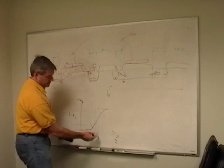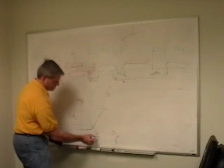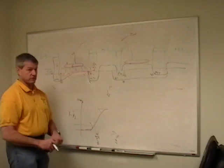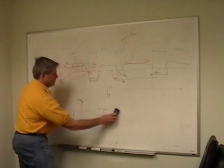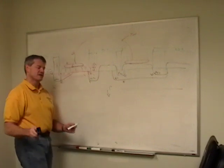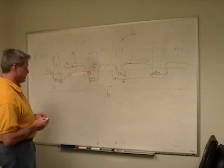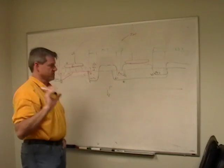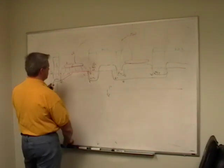In fact, it's much smaller than that. It's more like 2.4 to 2.6. It's down to tenths of volts, hundredths of volts. It's really hard to deal with. You have to be very careful when designing that kind of a circuit, because it's inherently unstable. It'll quickly saturate one way or the other and give you nothing. And when you're running right there at that little point where you can actually do something with it, the gain is tremendous.